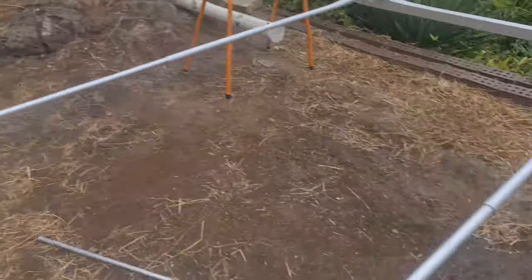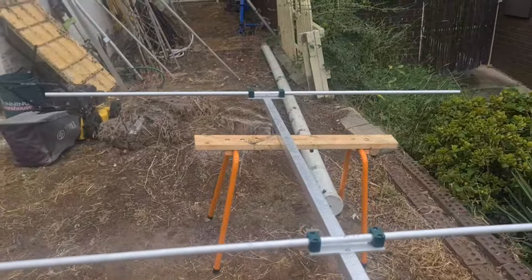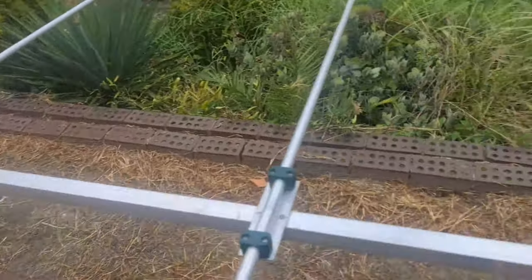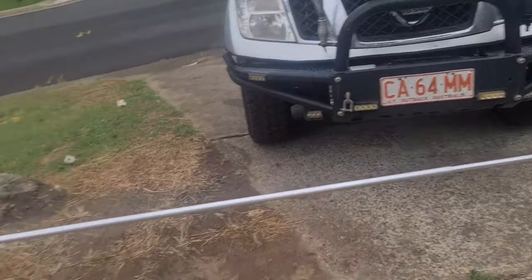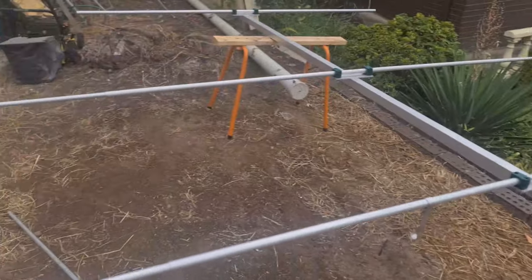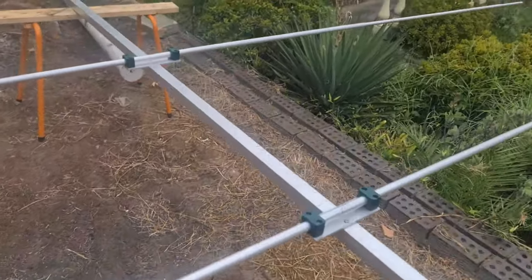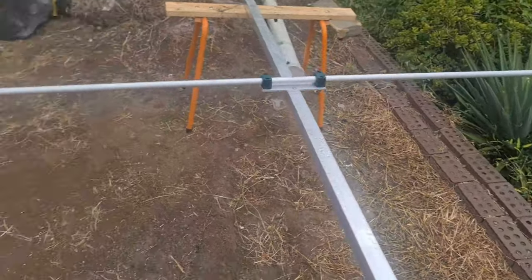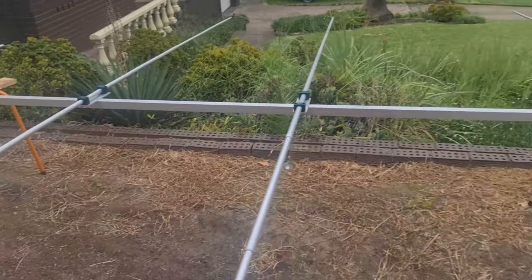She's coming together pretty well. I'll be very happy if I can get the gamma match to work — I've never made one. The last beam I did, I used a dipole as the driven element, but we're going to try a gamma match on this. She's about 5.6 metres on the reflector. The build I'm using as a template is the Serio 4-element beam for 10 and 11 metres, so I'm basing this off that spec.